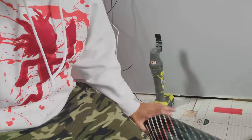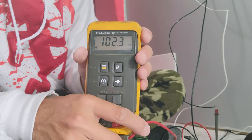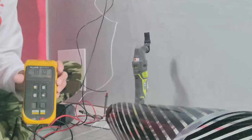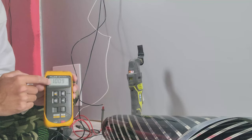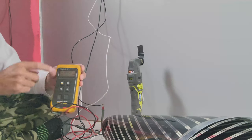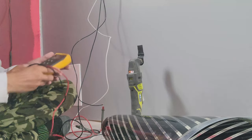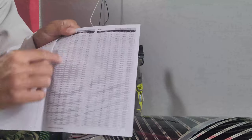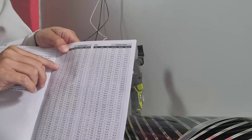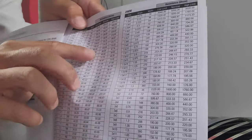I did the first initial test, which was taking an ohm reading and finding out the resistance of the heat pad. I've got the heat pad laid out and the original reading was 89.7 or something like that. After I cut it, we are within the nominal range according to the book. So page 12 has a chart — you calculate how long yours is. Ours is 1.5 by 8 feet and it reads 104, so it's within the specs.